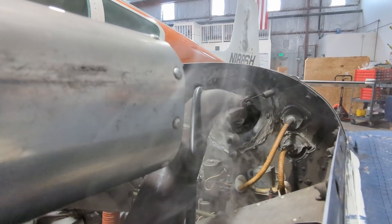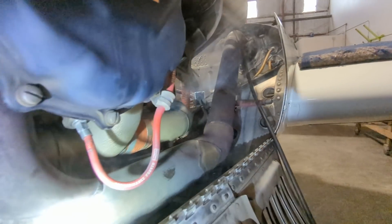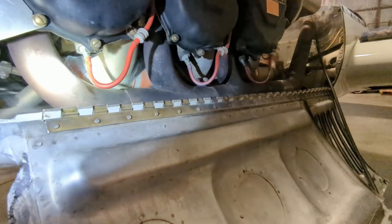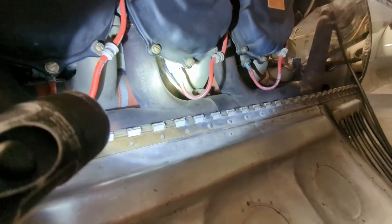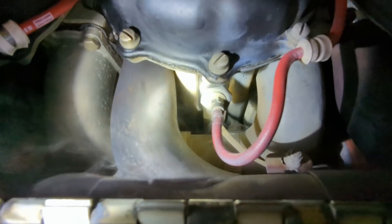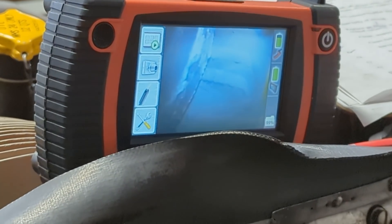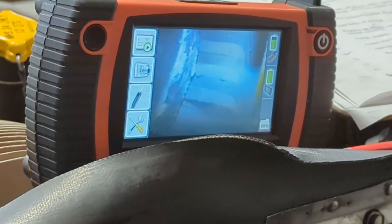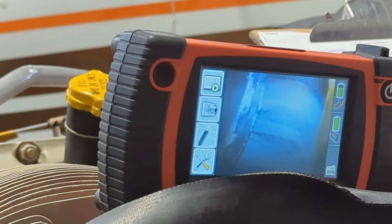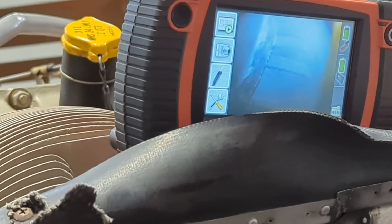Now it's time to play smoke 'em if you got 'em — we're going to do a smoke test on this exhaust system, which is really important on a single-engine airplane because you get your cabin heat from the exhaust system. That's not the case with the 310, but I do have a little exhaust staining on the number three cylinder I want to check. When I blow it out you should see it — if it's coming from that gasket you should see smoke from the lip, but it looks like it's on the right. So what the hell is leaking?